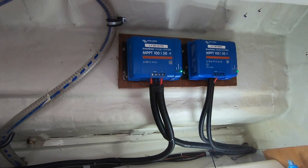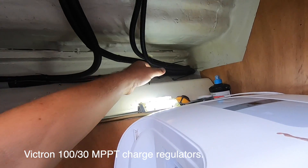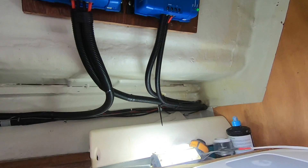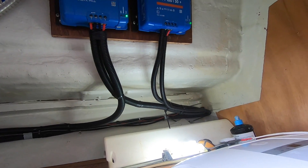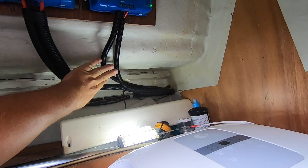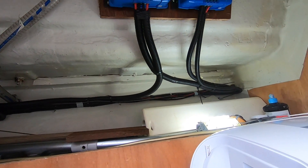Solar panels in series will give you a higher voltage, allowing your MPPT charger to work more efficiently. Solar panels in parallel will give you a higher amperage, and this may be an advantage if there is shading over the panels. The MPPTs are now live from the solar. I've put these conduits in, but the sticky pads to hold the conduits up have lost their stick - they are about 10 years old so the adhesive is done. Once they're all pushed up tight it will protect the cables, though they don't really need the conduit - it just makes it tidier. The cables are all double insulated.